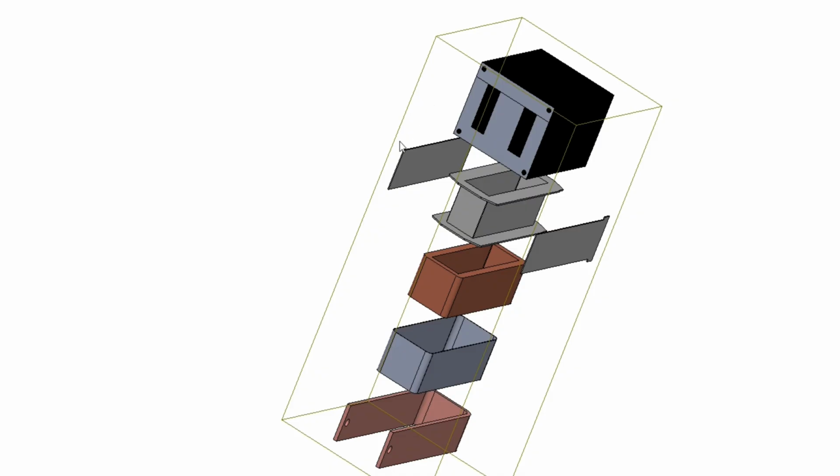If this alternating voltage is applied to a load, then an alternating current will result. The ratio of turns between the primary and secondary is balanced, minus losses, to the voltage on the primary and the secondary coil. The number of turns per volt is a function of the cross-sectional area of the magnetic circuit. So that's here, this face on here. I will break it down in a wee minute and show you more detail.